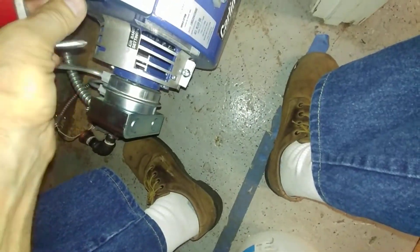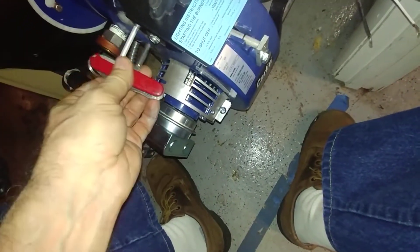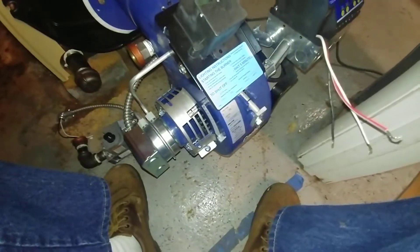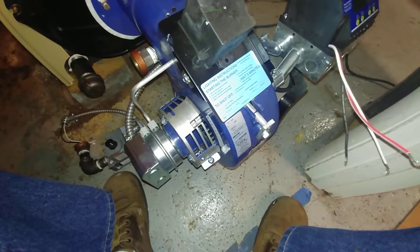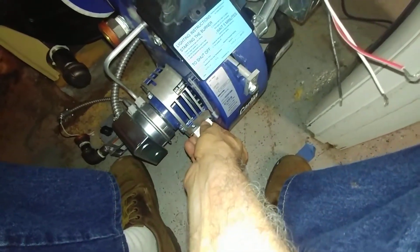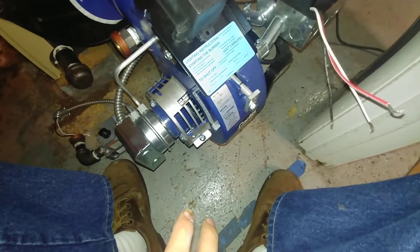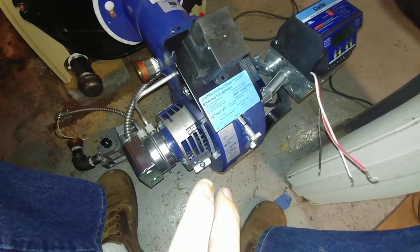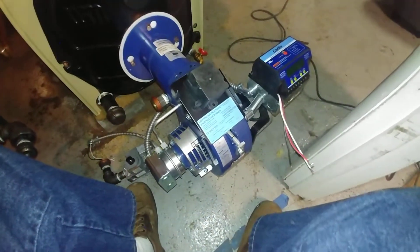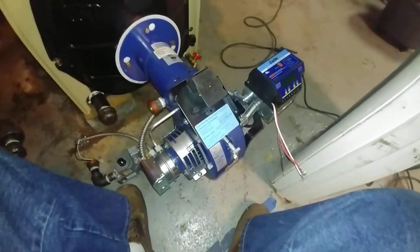The main advantage of using a power flame burner over an atmospheric gas burner is that you have much tighter control of your flame characteristics. With a properly functioning barometric, a correctly built orifice, and the air band set up and dialed in using combustion efficiency test equipment, you can get pretty good burner efficiency numbers. In countermand to that, these things tend to be a good bit noisier — the atmospherics are whisper quiet compared to this thing firing away. We've had some problems over the years trying to get these things quieted down.